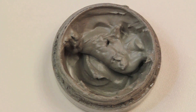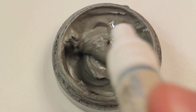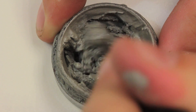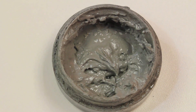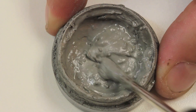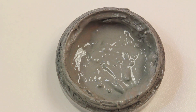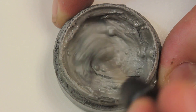Starting with our dry solder paste, we're going to add a few drops of flux and then start stirring it in. You can see how chunky and flaky this solder paste is right now. That's getting better — I'd go just a little farther. That's getting a lot better. If we overdo things we can dry it back out by just leaving the cap open and coming back every 10–15 minutes, giving it a quick stir.